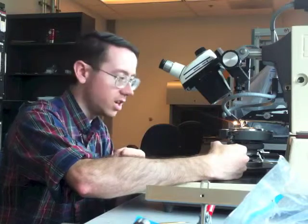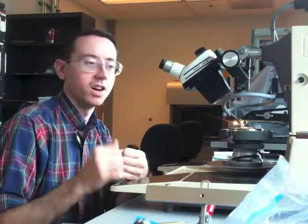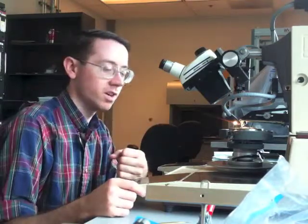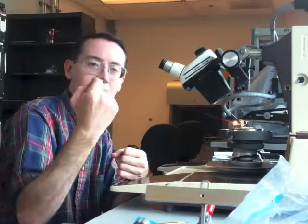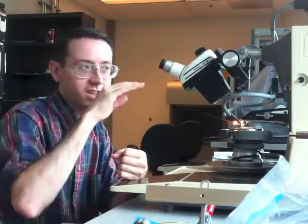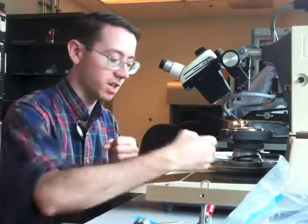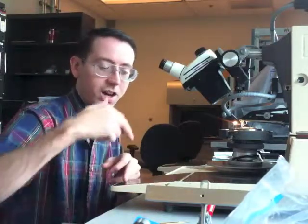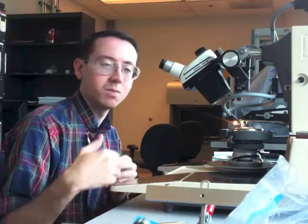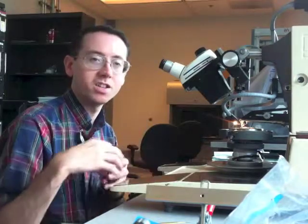Let me explain one thing — this is actually the cleverest little trick I have to show you. You're always going to want to keep the wire below, or at least not much more than just a hair's width above, the level of the surface of the chip. If there's any chance you think you could just about reach down and pull the wire up with your fingers, that's way too much. Ideally completely below the level of the chip. To do that, you have to get really creative — you've got to know how high up you want to arc it, and pay attention to the bend you're putting into the wire as you're arcing and manipulating it. It's all about the bend. The tension you build into the wire will determine its final state.